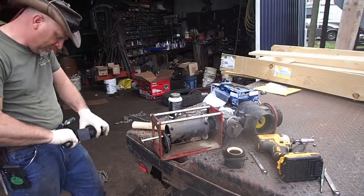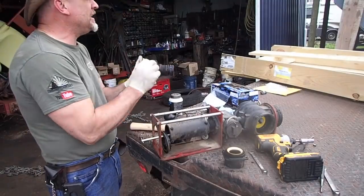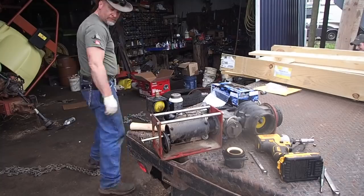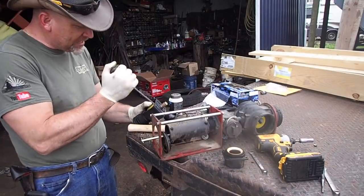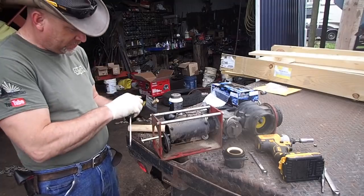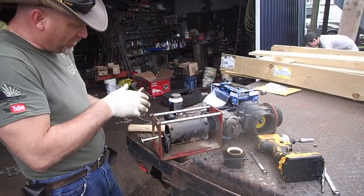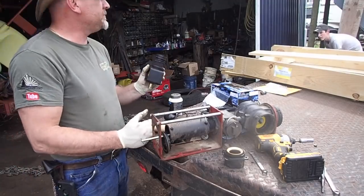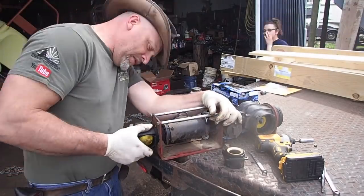So last night, we're trying to prime it, can't get it to prime. Finally, we put water into the thing, got it to prime, and I flipped the valve, and it makes this horrific noise. Sounds like it's deadheading like 2,500 pounds of pressure. These piston pumps produce one heck of a lot of pressure. I don't think it's that much, but it's a lot of pressure. And it started blowing past O-rings and the bypass valve was going nuts.